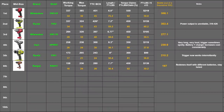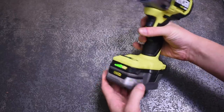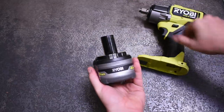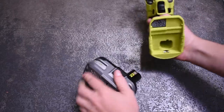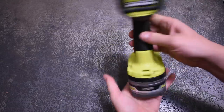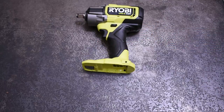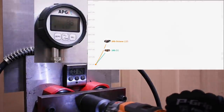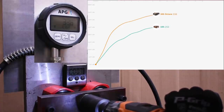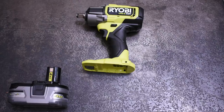At the end of this episode we'll take another look at the ranking chart to see if the Ryobi can improve on its old score. Here we have Ryobi's HP battery, model number P192 — a 4 amp hour to match the bargain bin 4 amp hour pack from episode 22. Besides the HP branding, the HP packs have two little pickups on the back, and the tool also has two terminal pickups, allowing the tool and battery to communicate with each other to open those high wattage floodgates.